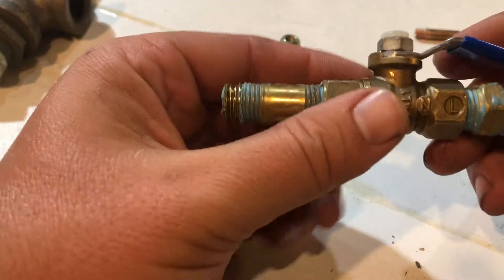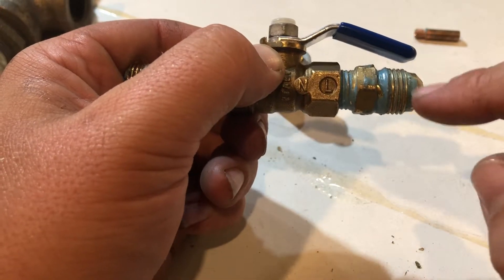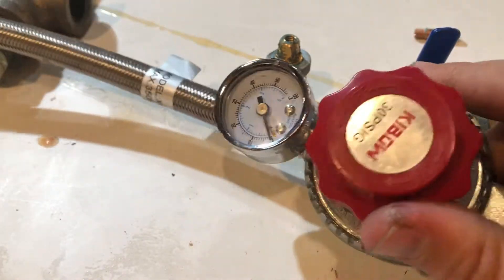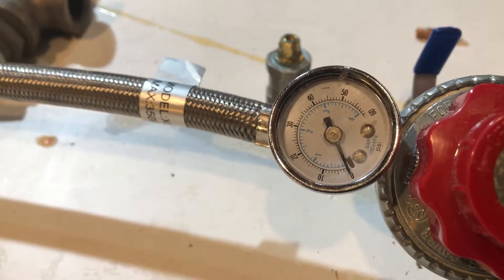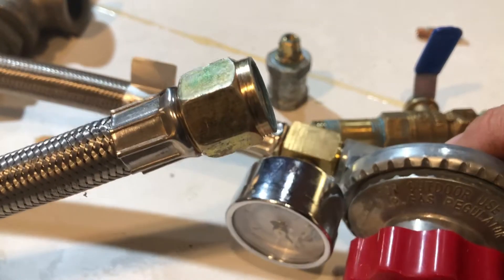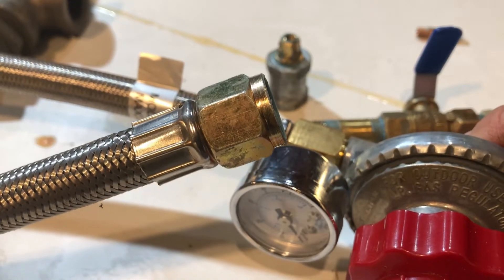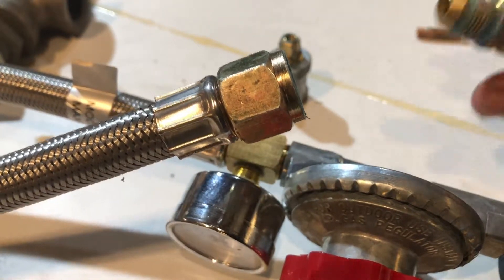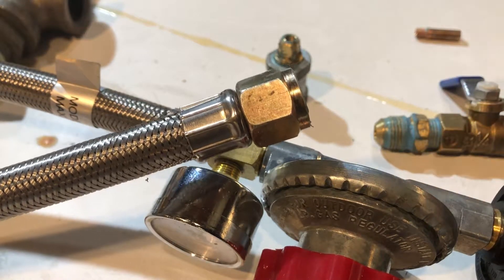After the brass plug, there's a galvanized quarter-inch coupling, then a quarter-inch by two-inch brass nipple threaded into a quarter-inch quarter-turn ball valve, which then has a quarter-inch by three-eighths flare fitting for the regulator. An important thing with Venturi burners: you need a high-pressure regulator. This one goes up to 30 PSI labeled, but has a gauge up to 60, and on a full tank I can get it to read up to 45. The three-eighths flare fitting is pretty standard — it hooks up to most barbecues — just make sure you get that fitting.